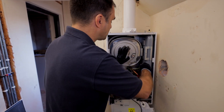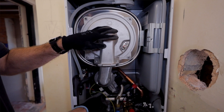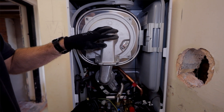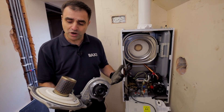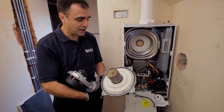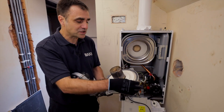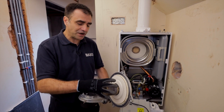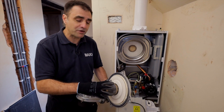I've got my spark electrode — a very easy-fit connection from the gas valve into the fan. Remove the wire connections for the fan, not forgetting the earth in the corner, and then the whole lot just pulls out. It's very easy to remove the whole burner section. Looking at the burner, I've got my seal — all I need to do is check it's still in good condition and not going brittle. You can see it has a serrated-edge burner, which holds the flame closer to the burner, giving more heat per square inch.